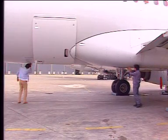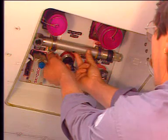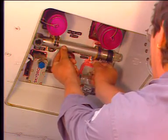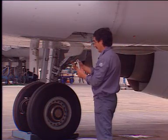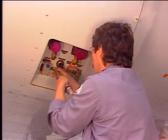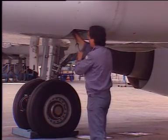The second operator opens the yellow ground surface access panel. Unlock the hand pump control handle quick locking fasteners. Pull out the hand pump control handle and set it in operation mode. Install the hand pump control handle in its pump. Set the manual control selector to the hand pump position.